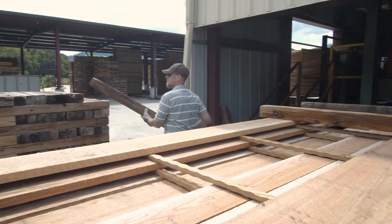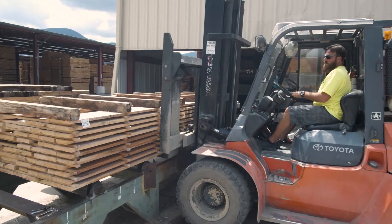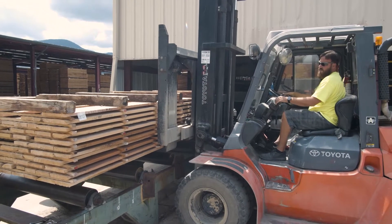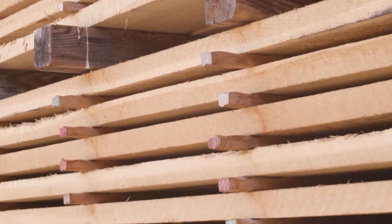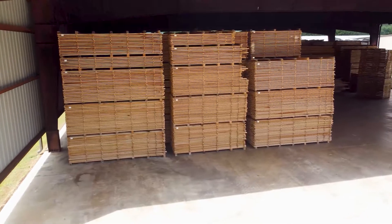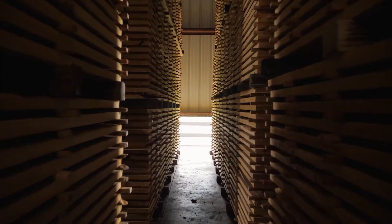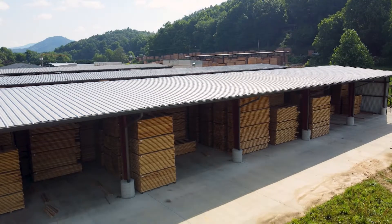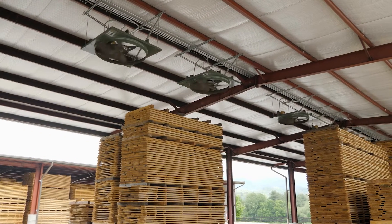The reason that we take such great pains in the initial grading and stacking of the lumber is to make it dry flat. We have our pile bottoms and stick alignment spacers — everything to ultimately give the customer the flattest and cleanest lumber possible.